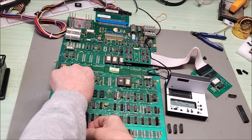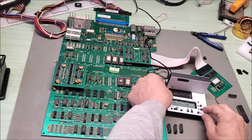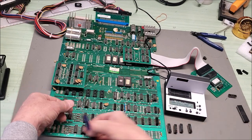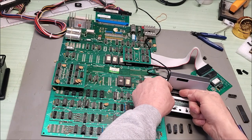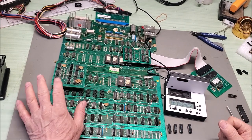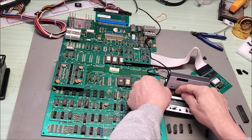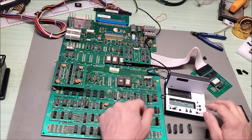Then this one — 4M was OK. And 4R is OK. So it was just the RAM at 4P that was bad. I'm going to retest it in case it just wasn't making good contact in the socket. Yeah, it's bad.